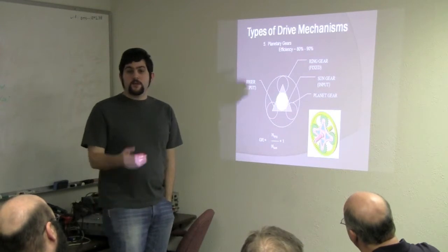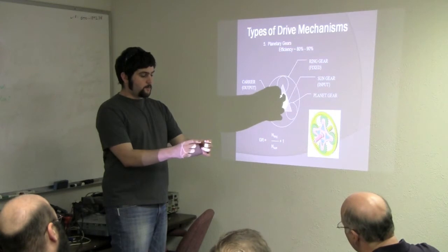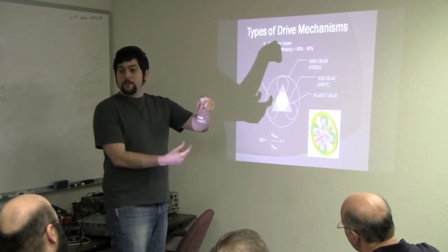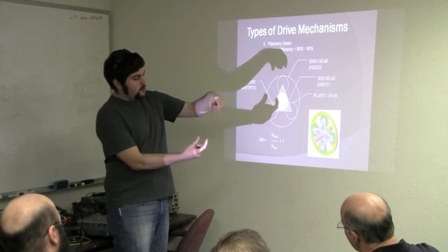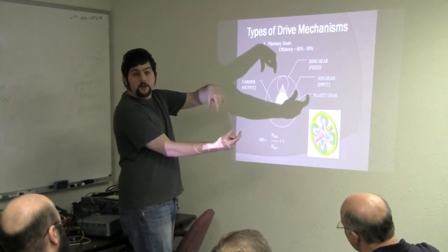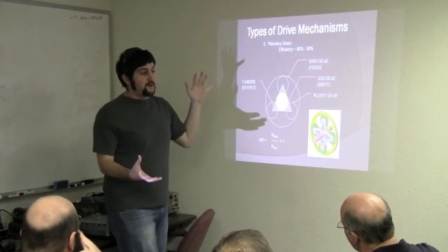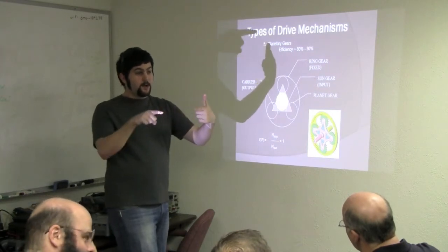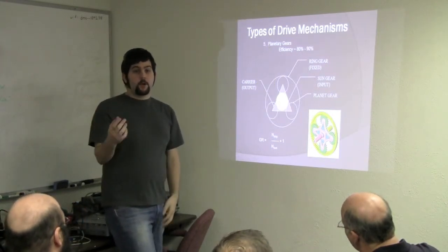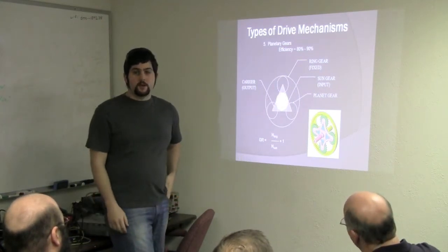I mean, essentially, if you ever encounter a gearbox where your motor is directly in line with your output shaft, it's probably a Planetary gearbox. Every other type of transmission, your motor is going to be offset from your output shaft by some degree. So that's the number one way to tell if it's a Planetary. A drill, the motor's right behind the driver. So if you take apart any robot and you see that, that's going to be your indicator you've got a Planetary gear set.